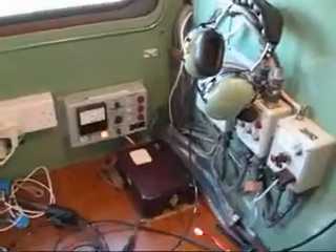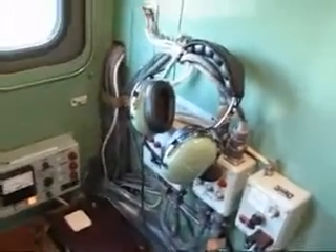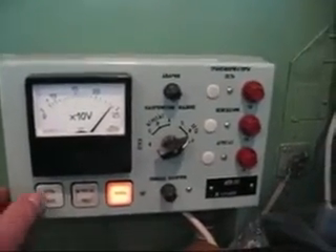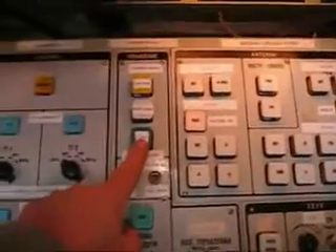We're back in the station now, we've got the power applied, the aerials up and we're ready to roll. This headset is the logging operator headset and the logging operator normally sits at this desk. We're going to push the on button and the first thing you'll hear is the alarm going on the console behind me, which tells me that the exciter is not locked. We're going to cancel that alarm by pressing the alarm cancel button. Next we're going to turn on the heaters for the PA - these take approximately 15 minutes to come into service.